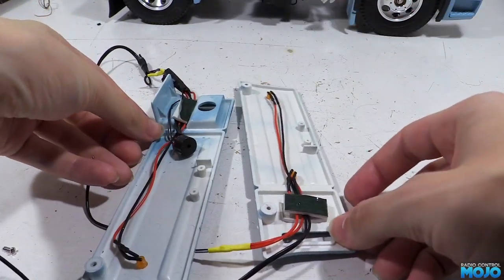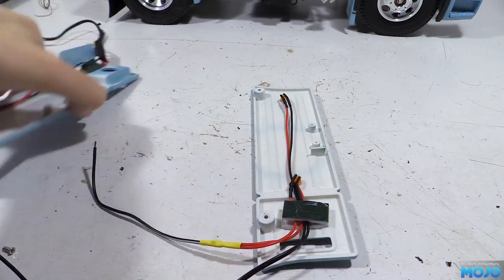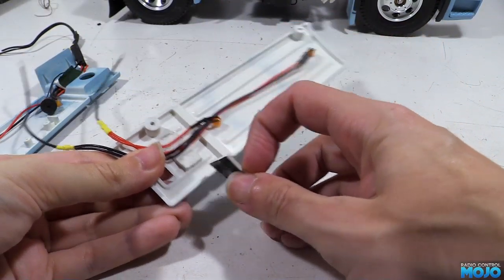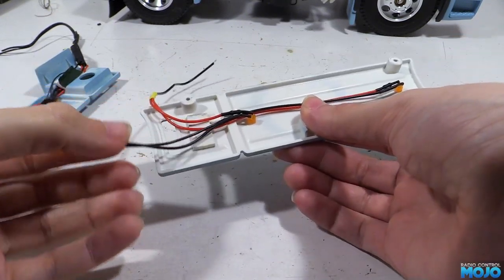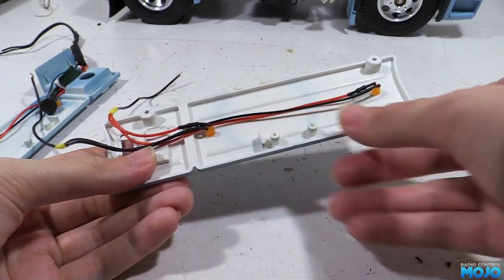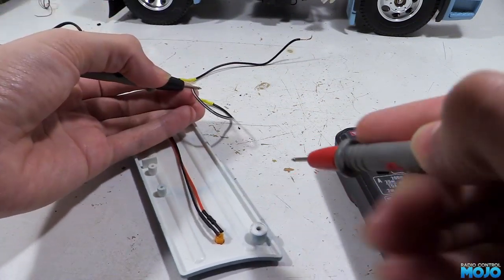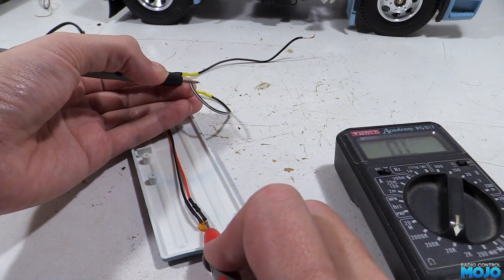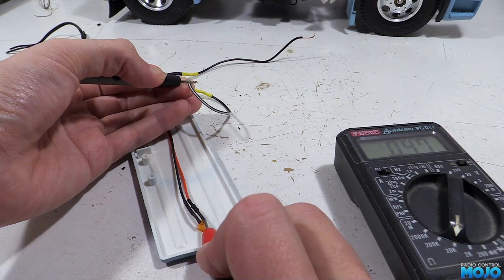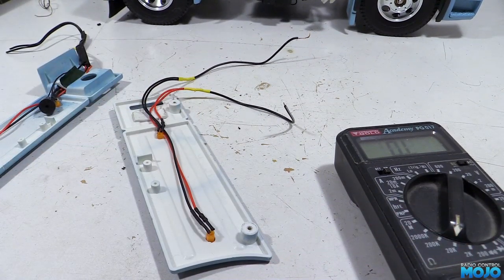The side skirts already have the LEDs fitted and wired out but my concern is they're not going to be bright enough. We want them to run as bright as possible with a bit of a safety overhead at 5 volts, so the electronics to control them can do some fancy lighting effects. Each of the LEDs has its own resistor which is good, but I've got a feeling they're going to be set up for a higher voltage — probably a 7.2 volt NiMH pack. We can measure the resistance with a multimeter and check. We can see there's a 470 ohm resistor in the line, but we can safely go down to a 220 ohm, roughly doubling the current for more brightness.